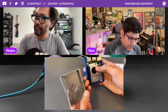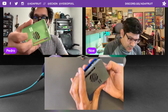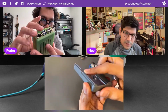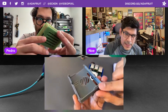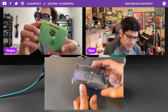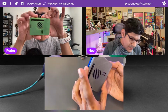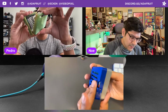For the top half, it's always important to have some cutouts for the GPIO header. So it's that 2x20. It's the same. There are some snap fit nubs here, and there's some corner things to keep it registered so it doesn't slide out. But you got some strategically placed snap fit nubs here that will grab onto the inner nubs of the case of the bottom half. So we just line that up. You get a nice click there, and then a click right there. So that covers it up.